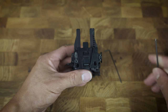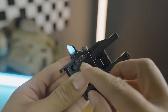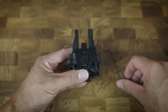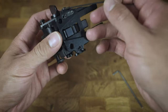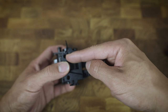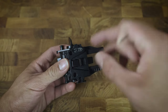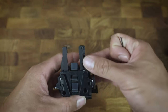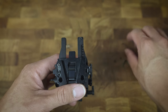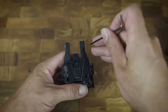Now let's get into how this dovetail works. There's the dovetail, the retaining tab, and the side that actually adjusts. There are two little locking hex screws that need to be loosened so the dovetail can move up and down on the little track. There's also a very small worm drive here — what it does is push the dovetail forwards, and that's how you adjust the shape of the dovetail so it tightens or loosens depending on what you need. There's also a screw here that locks the dovetail in place so it can't go past its set position. I actually recommend taking this screw out so you have a little more leeway to eliminate wobble and get a really tight dovetail fit. This is also a 2mm screw.